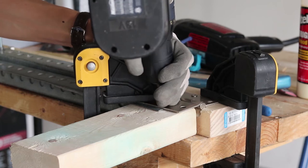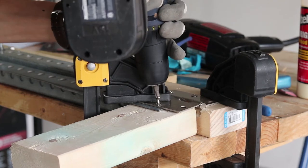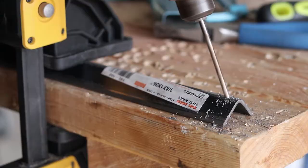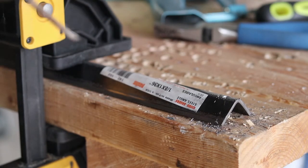To install the 2x4s as a lever, I used some screws and screwed that into the bending surface. I also had to cut out the top plate, for which I used a one-inch metal angle. I filed down the edge where I was going to drill, and drilled a hole so the bolt can stick through and be secured by wing nuts.